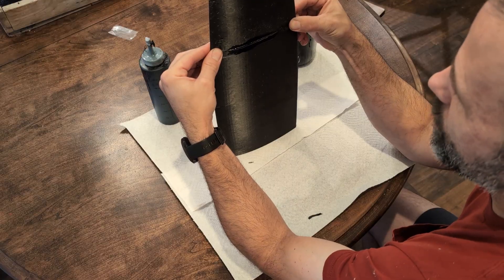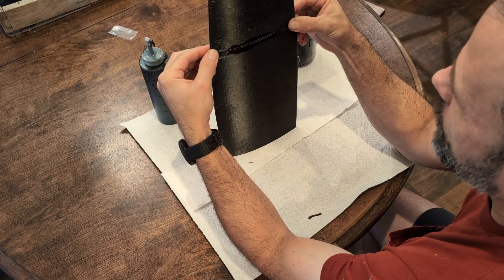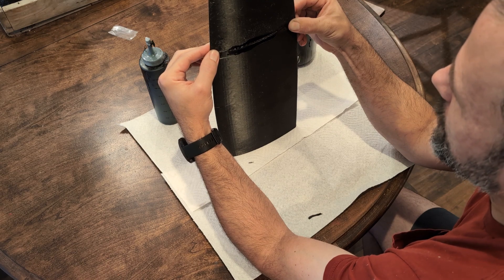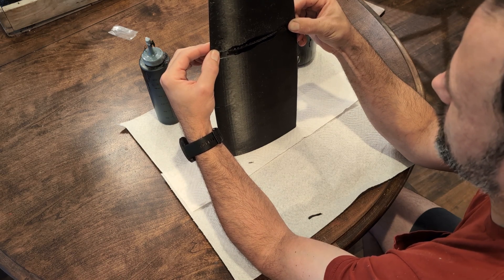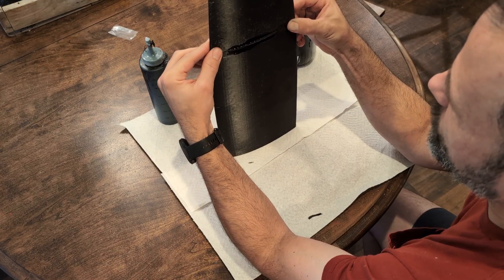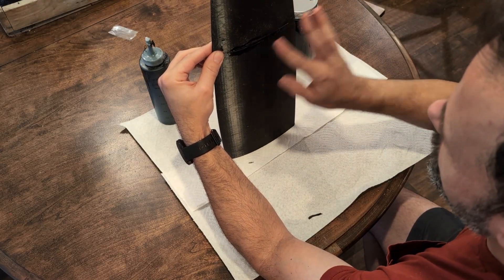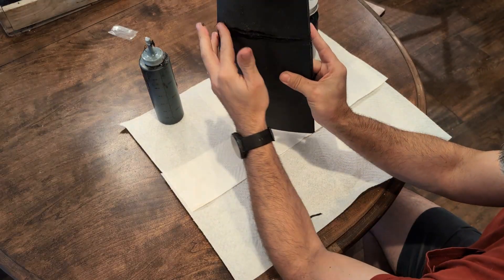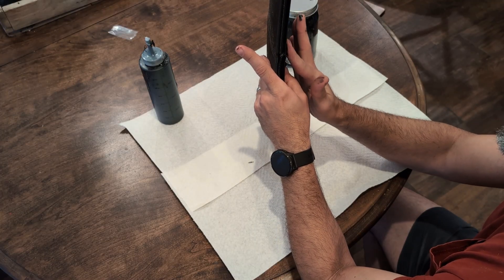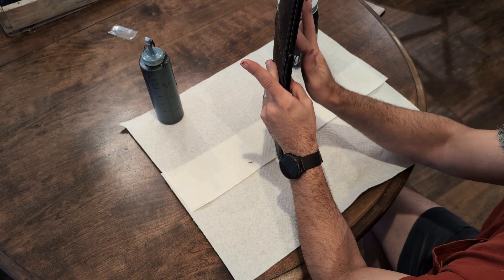What this is doing is actually melting the ABS, and then as the solvent evaporates it all joins back together and makes it into one piece. It's a really strong joint, but we're going to add a step to make it even stronger. The stuff that squishes out the side I just spread with my finger. You can wear gloves, but this ABS plastic when it dries is pretty easy to peel off — kind of like Elmer's glue.